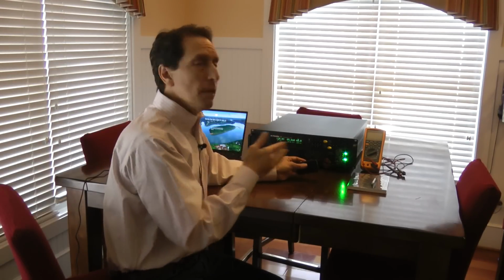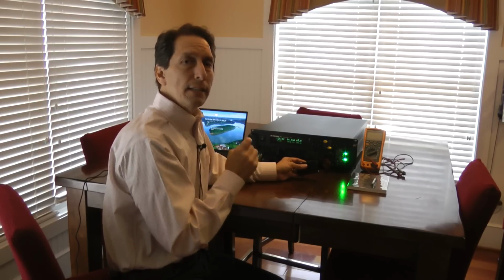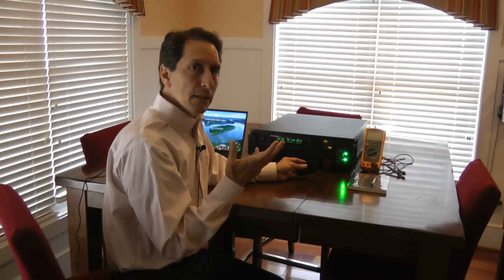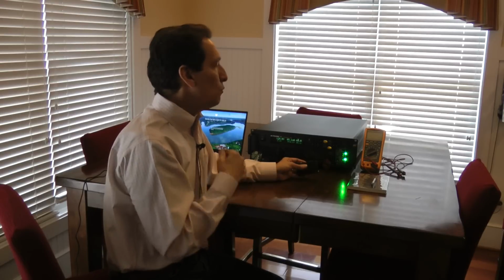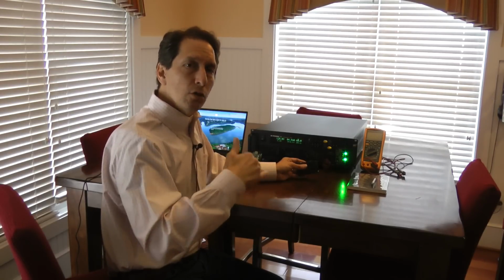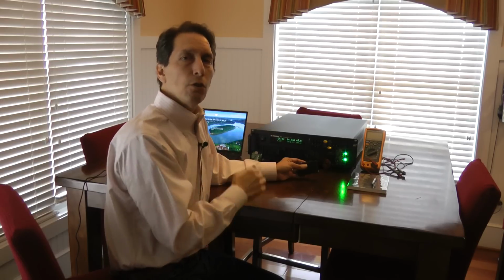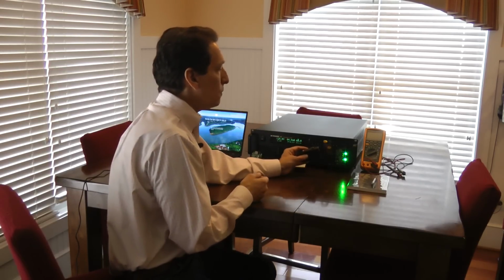Now, the time that alarm sounds is configurable in the device. I can make it what I want. I set it for between 1 and 2 seconds. So it'll be a temporary warning that, hey, something just occurred. You don't want it to just keep sounding forever, but you want to warn them that something just occurred. And then shortly after that, as the voltage levels start to rise on the line, it would turn on fully and just stay on.